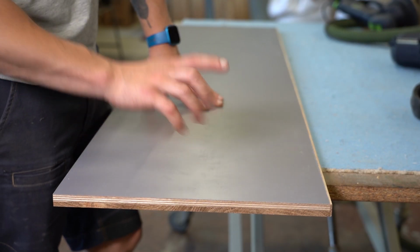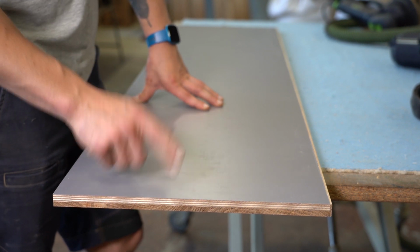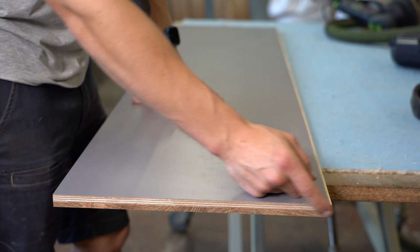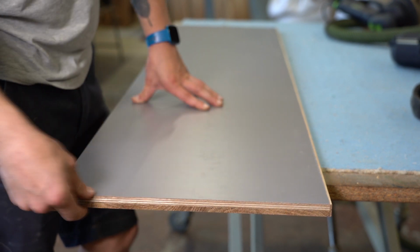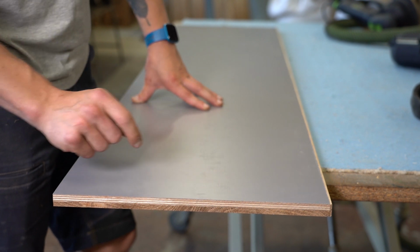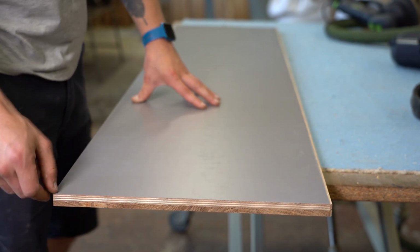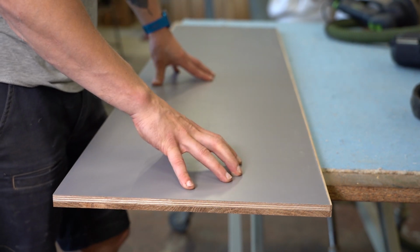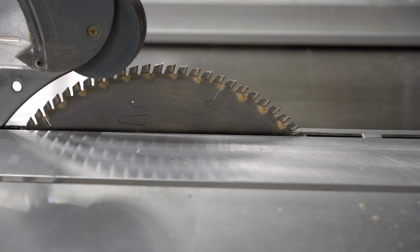One side of the plywood is covered with phenolic film and nothing sticks to it, so when I place this panel into the frame, I'll be able to glue the edge, the front side, but I won't get any bond with the inner side. So I'm thinking to remove a bit of this film around the perimeter, so I would gain more adhesion surface.